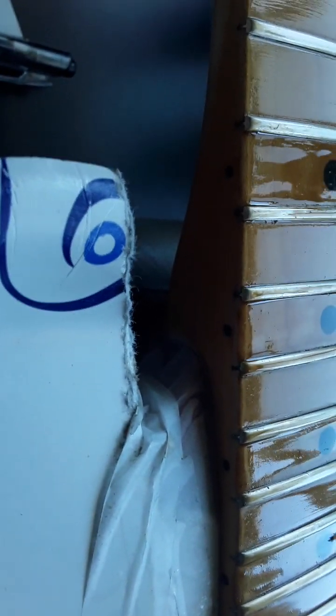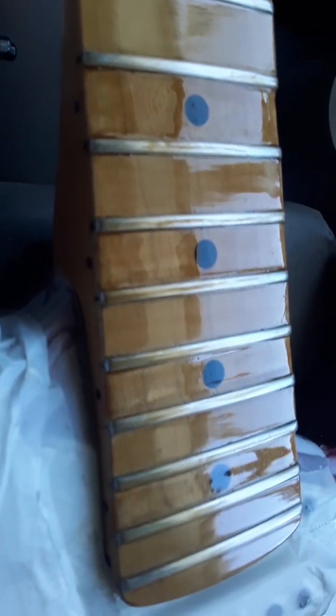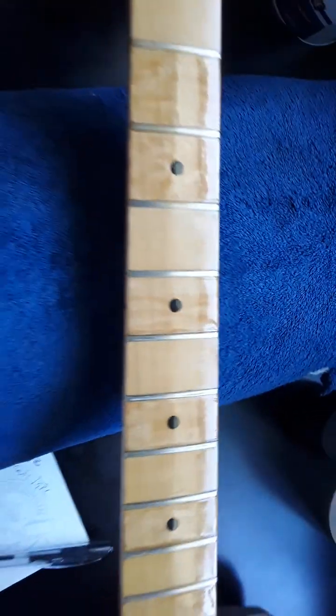It's hard to tell — it's not too bad. Now that I'm filling it in, it's stain — we have no urethane on there yet. I think I can alternate back and forth, but this oil-based stain seems thicker than urethane. You wouldn't think of stain as thick and resinous, but this one does have a certain density. I even brushed it onto some of the finished frets for more uniform color. The colors pretty uniform — we had that striped effect, it's still a little stripey, but I think it'll even out. Overall looking pretty good.